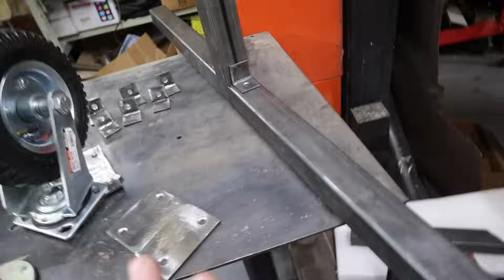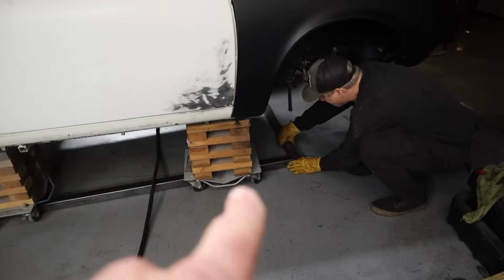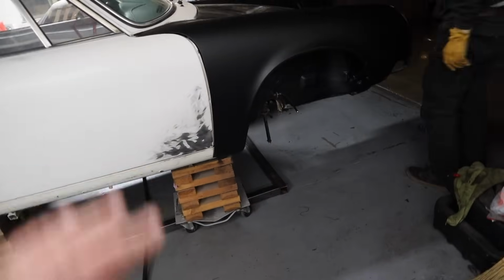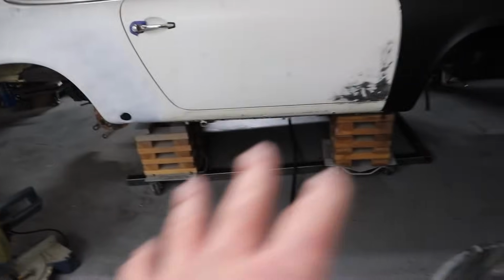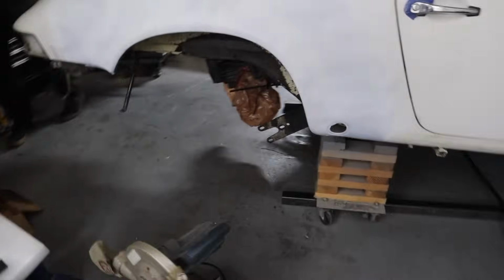But for right now, what we're gonna do is Mark has just set these up under the car. We're gonna get our first 3 pieces, which is going to be the 2 right angles, and I'll tack those together. And then if we can get the wheels underneath, we'll have some idea of how long the uprights need to be to connect to the factory mounting points.